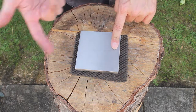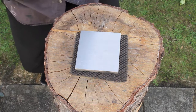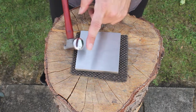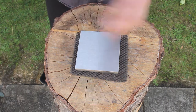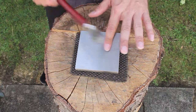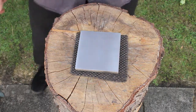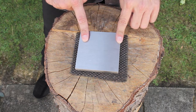It's very important that you try and look after this surface, because any dents or marks in here are going to get pushed into your metal. So keep it nice and smooth. It's also worthwhile keeping a nice polished hammer for working with it — keep one nice and clean and polished just for working with wire on your bench block.